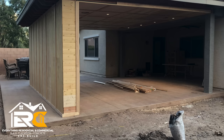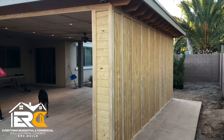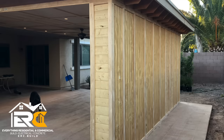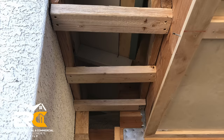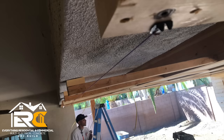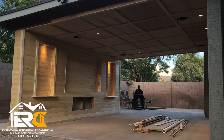On the backside we're using basic T1-11. If you look below the baseboard there's a little piece of galvanized flashing — you can see it's like a little black piece that goes below the baseboard — so if water gets behind the T1-11 it kicks out there. We have the 1-by-3 select pine for our 16-on-center nailing. To align the stucco we just popped a string and framed it out. It's a bit of a weird transition here, but we just popped a string and framed it out so the stucco guys can attach their stuff and go.